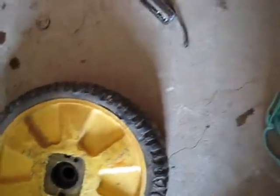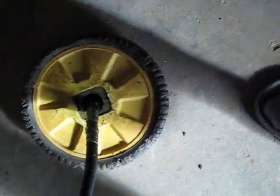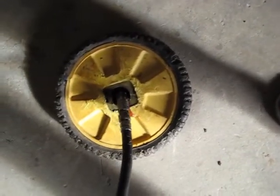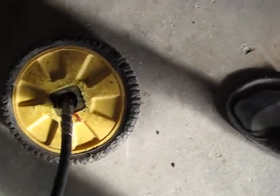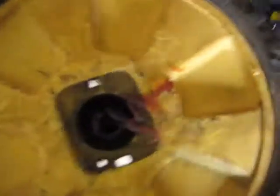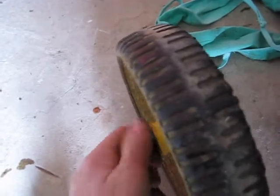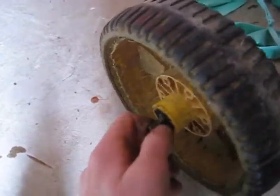Top that with some grease. The thing's going to be clean in there. You can clean it if you want, but in this case it doesn't have to be cleaned — just get the grease pump and pump a bit in there. Get it in there with one hand. Might get a bit of a mess, but get the points like that, pull the hole up and around that front surface. Push this pin in, stick it in with the grease. Now when I spin it, it should be very easy — that's a much, much very free spinning pin now, so that's good.